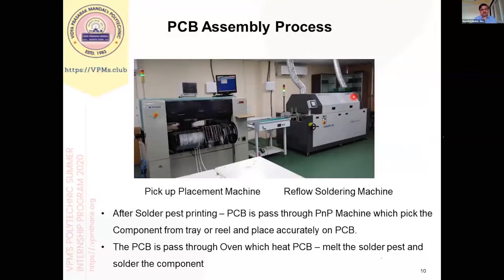This is a brief idea of how automatic or higher-end PCB assembly units work. This type of process requires a very high level of investment and is only possible for products required in very high volumes, like mobile phones or audio-video equipment. But equipment like industrial equipment, which is not required in such high volumes, cannot have fully automated systems, and some processes must be done manually, with a lot of component or material handling between one process and another.